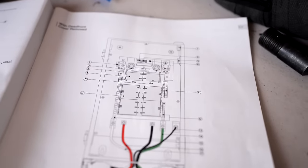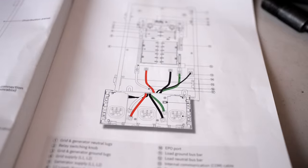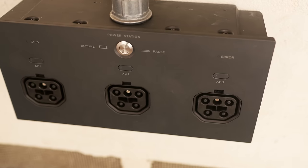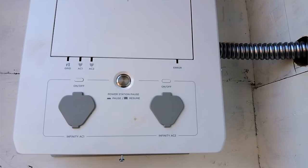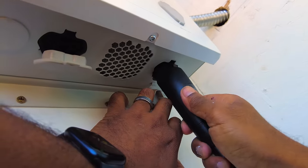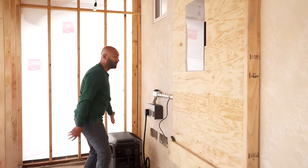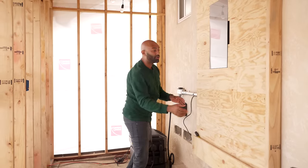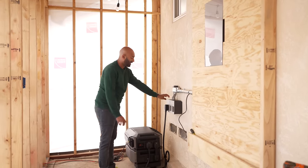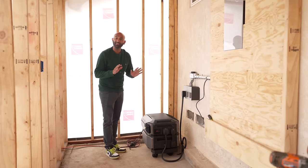Remember in the installation video, there's actually a little section below where all the batteries attach to. Where is that? Well, it comes off. A couple of screws, you can separate them, which is brilliant, because in the old Smart Home Panel, they were attached right here, which meant one infinity cable, 6 feet, limited where these batteries could be placed. So 6 feet is only about, you only put it about here. We couldn't put them over here, for example. In the new one, you can run conduit, run the right size wire, and mount this anywhere. So now we have this over here, so we can have the batteries all live in this section.